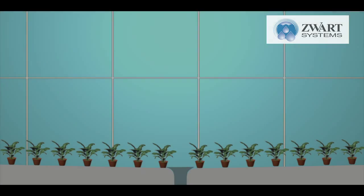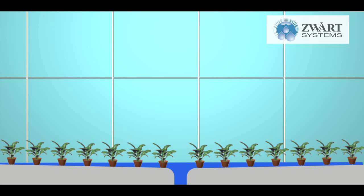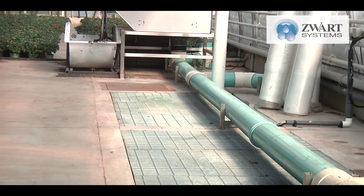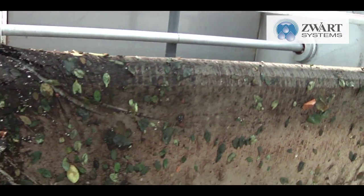With a traditional floor, the greenhouse is shaped in a V formation, or sometimes in a W, depending on the width of the floor. Water is pumped into the center of the V, and the floor slowly fills. As the water fills from the center, it gradually fills up the floor to a depth of approximately 1.5 inches on the rubber or concrete barrier. Once the water has reached its peak, it's either held for a few moments, or, depending on design, it's released right away. The water drains into the same pipe it came in with, but is diverted beneath the floor to a larger drain that brings it back into the holding tank's area. It's then pumped out over a filter and returned back to the tank from where it began.